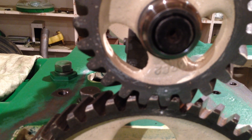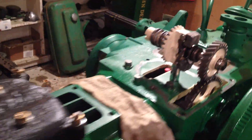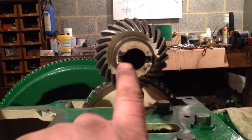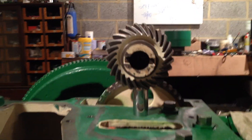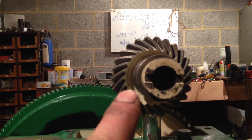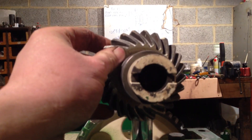I don't know why — that's just how it is. But by lining that up, if we come round to the other side, the drive for the magneto — which is this chap here — is also horizontal to the engine this way. It is slightly off there, but that's only because the gear is not in its casing and it's only perched on a socket. You can move it one way or the other and it will go horizontal and line up.